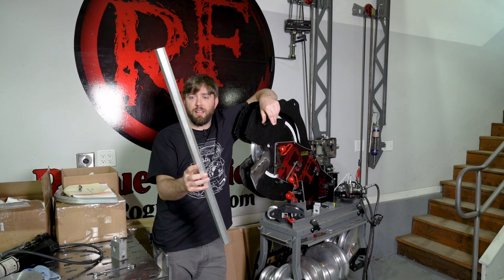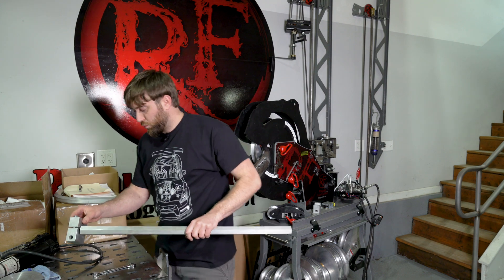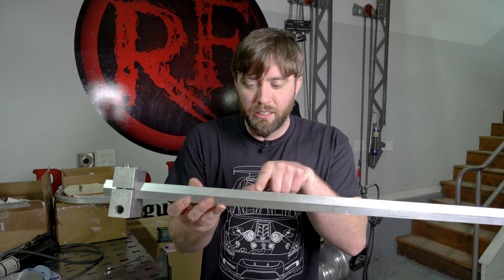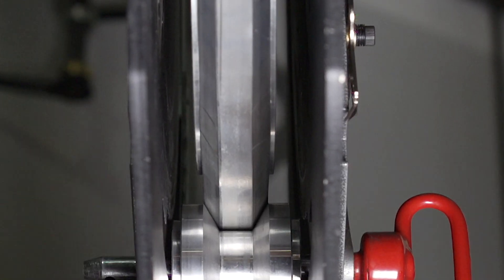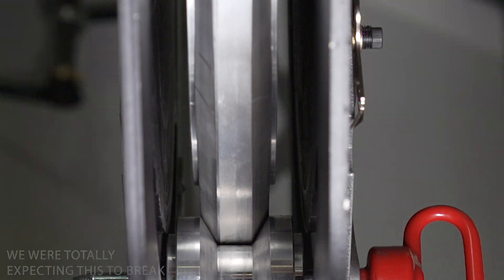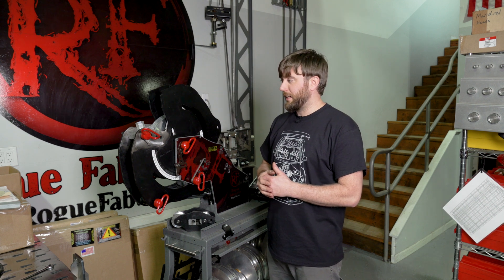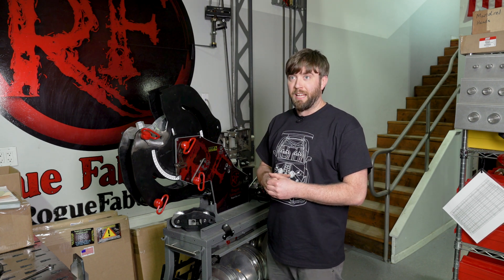It's been 24 hours. We let this annealed tube sit and let its grain structure go back to normal. Now we're going to put it back in the bender and show you what happens. Make sure the clamp locks nice and tight. You can see here, these are all of our lines from where we annealed it, so that's where we're going to be bending it. As you can tell from our slow-mo shot, it did not crack. This was a little bit of a surprise to us, but this is what experimenting is for. It seems like when you anneal the tube, some of those effects are longer lasting than we anticipated, giving you a larger window to bend your tube.